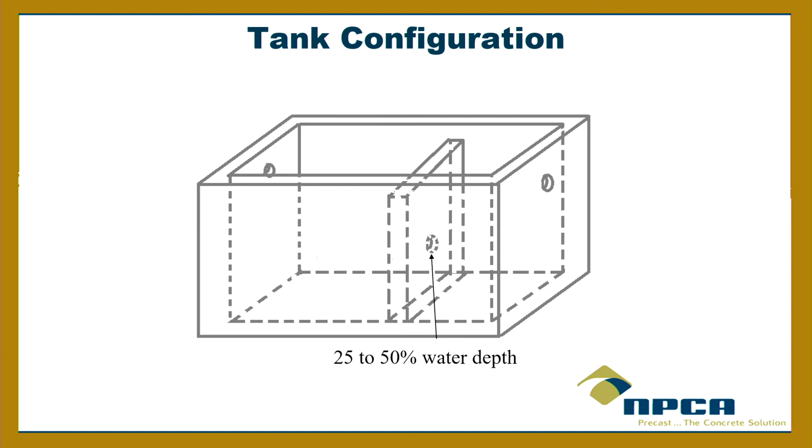Anybody else run into that? There was a hole between the clarifier tank and the pump tank. It was on a drip system, so it has filters on this system. And they kept getting plugged like every other day. So we eventually pumped it, got in the tank, and found there's a hole between the 2 tanks. Oh, I see. Well, I'd like to talk to you about that a little more afterwards, if you don't mind, because I want to explore that a little bit.